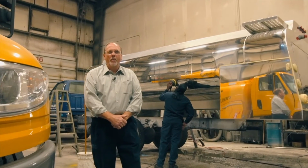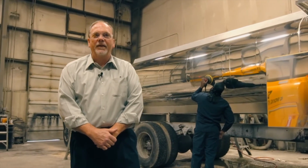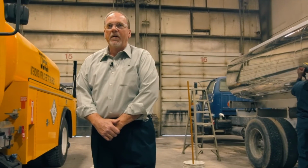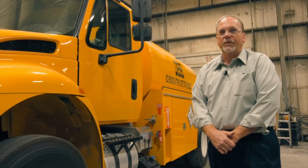From the finishing department, our tanks are taken to the cleaning area where they go through a mild acid bath, sanding if they have any scratches or blemishes, and brought back with buffing compound to the original luster. From that point, they're taken to the mounting department for us to mount to the customer or shipped to the customers for them to mount themselves.